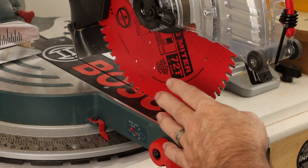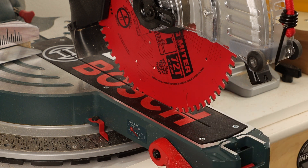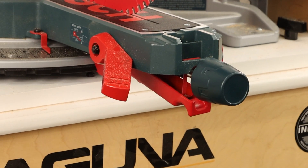I've seen people complain about a 1/16th deflection either side of the blade, and that's just too much for any kind of accuracy. I'll show you how to tighten that up and solve that issue, but first let's go back to this miter detent issue and if you have any slop with that I'll show you how to sort that first.